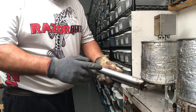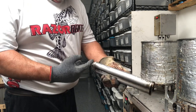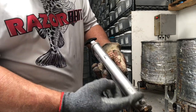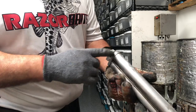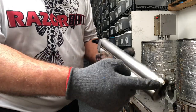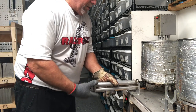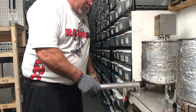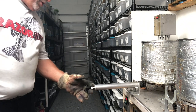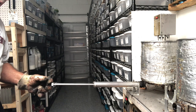I know some people are curious about when you shoot laminates, how you identify which is the top and which is the bottom. What I've done on my injector, I've actually engraved it top, and I did some scratching around on it, so I can see at any time what's top and what's bottom. I put the injector into the port on the top, I rotate it, it locks itself in position, and then with my good arm, I pull my plastic out.